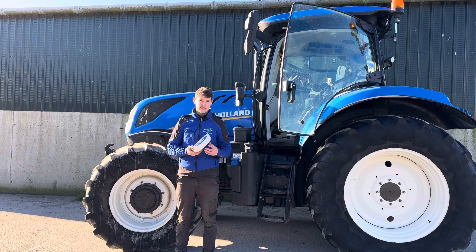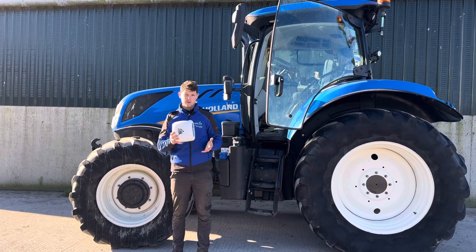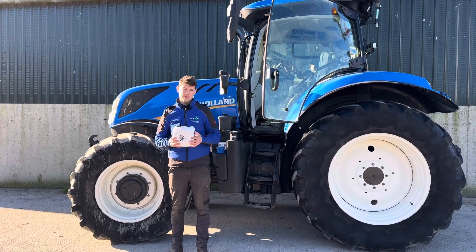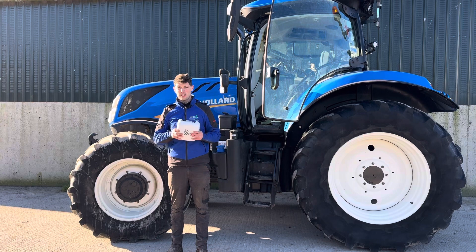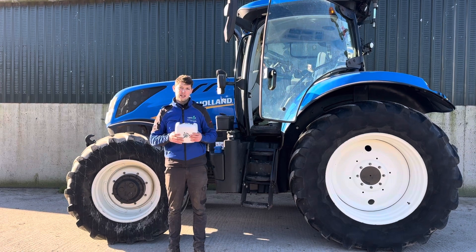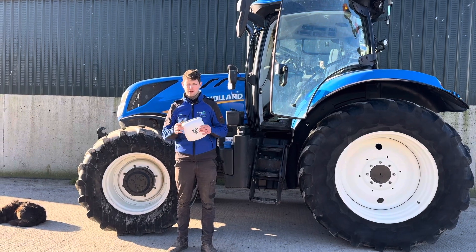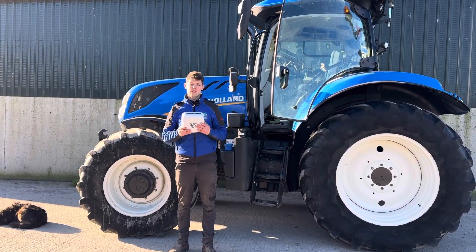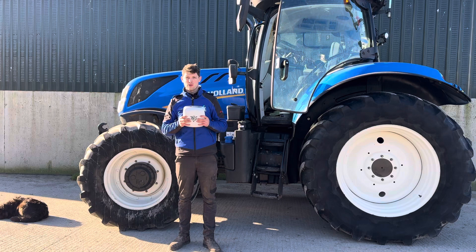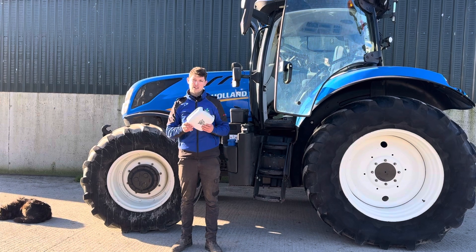On corrections, Centre Point is very popular and will bring us down to 1-inch accuracy. We have two options: Centre Point Standard and Centre Point Fast — both are 1-inch accuracy with 1-inch repeatability. So coming back to that field after 1 hour, 1 day, or 1 week, your line will only have ever shifted 1 inch if anything at all. Convergence time for Standard is 10 minutes and for Fast is 3 minutes. So with Centre Point Standard it could take up to 10 minutes to have full signal and be ready to go, whereas with Centre Point Fast you can have that within 3 minutes.